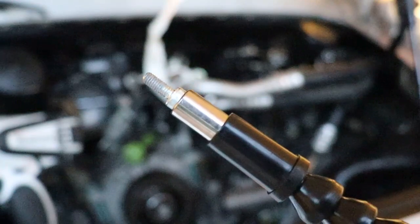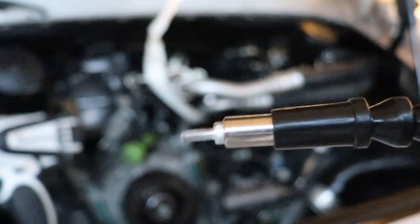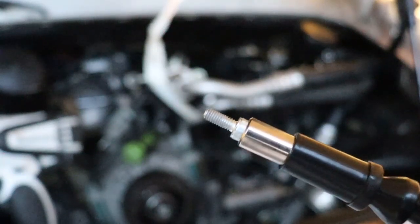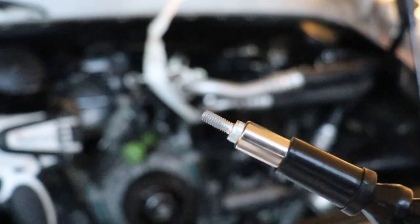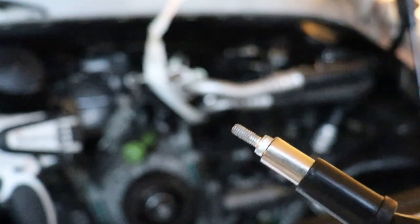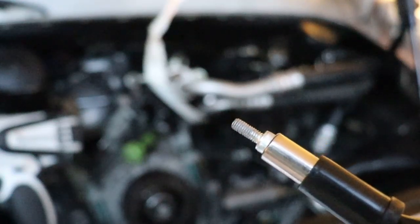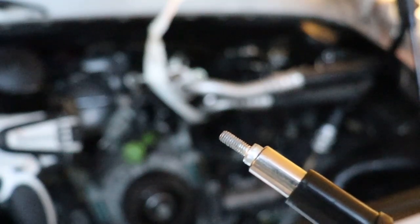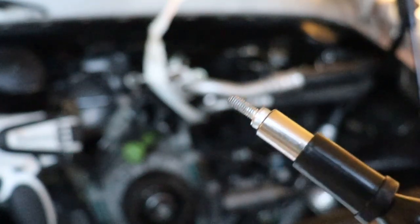Okay, I'm gonna go ahead and install number seven, the screw. I'm just showing you how I'm gonna do it. I'm putting it on a flexible extension, and then I can just turn it, just like I turned the drill and the tap, just like so. And I glued it on with a little bit of crazy glue, and once the threads go in, it'll be easy just to snap that off. And before I put it in, I'm going to put some gray gasket sealer on the threads, a whole bunch of it, so it goops up and makes a nice little flange around the top and seals it. But I can't show you that, so that's why I'm showing you this now. So off we go down to install number seven.